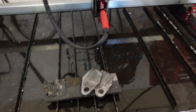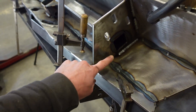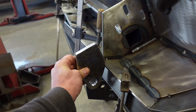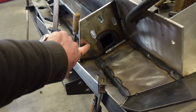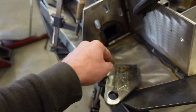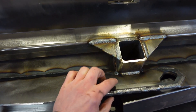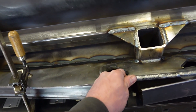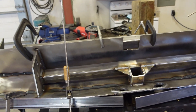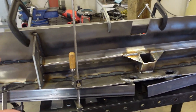We've got some hooks here that are going to go through the bumper and tie into the mount. We're going to cut a half-inch strip out of the bumper, run these hooks through, and actually weld them into the mount — making an extremely strong recovery point that's directly bolted to the frame. It's going to be welded inside and on the outside, very sturdy. We put an extra 3/16ths plate here tied into the hitch to stiffen everything up around the hitch and for the chains. We've got gussets in it — ready to finish out the sides and grind everything smooth.